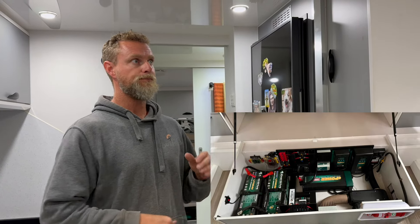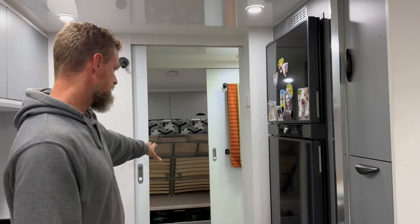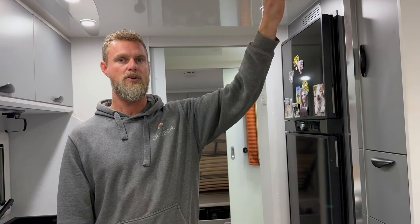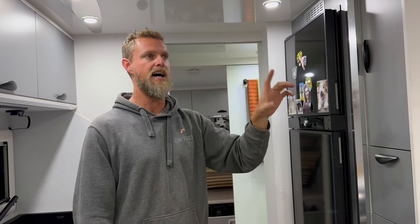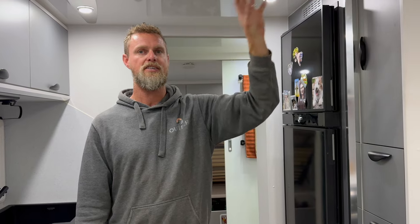With this package, all we've done is taken out the E-Pro and put Simarine in. We've left the existing Enerdrive board underneath the bed and added to it, and we've left the existing 170 watt solar panels on the roof. Part of the inspection process was to look at how everything was cabled, because the owner told us they were maxing out at about 25 amps, which isn't quite right for the amount of charge they should be getting in full sun from those four panels.